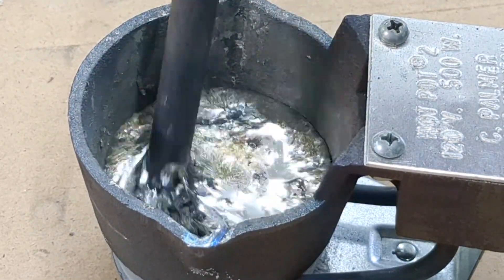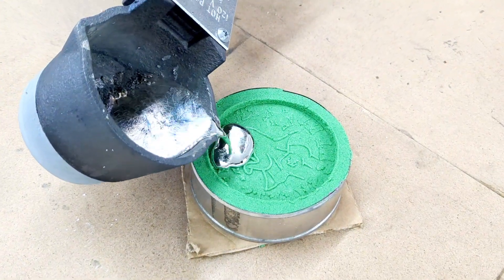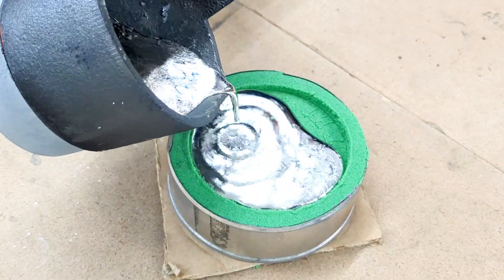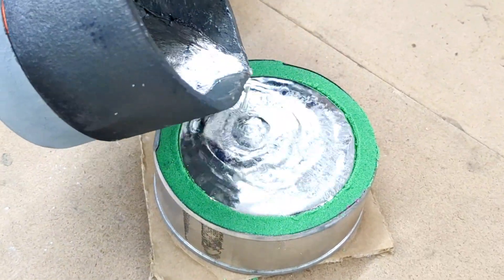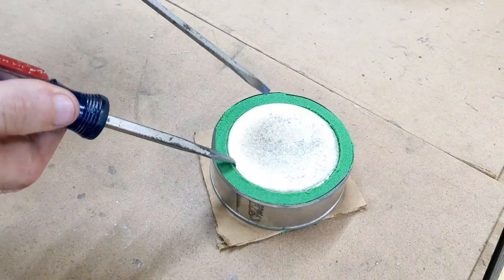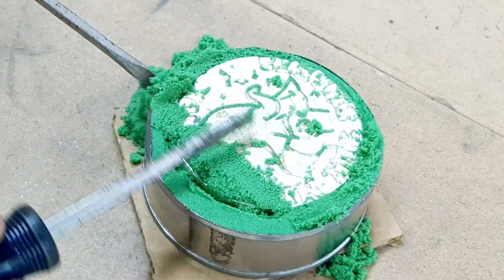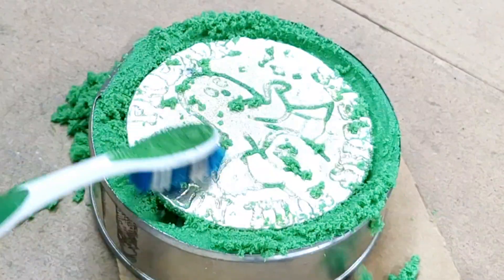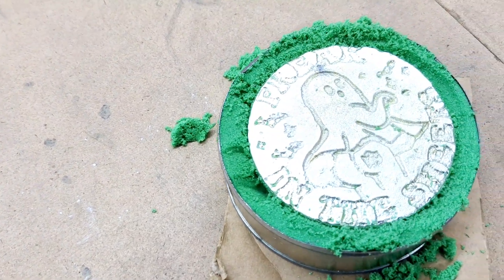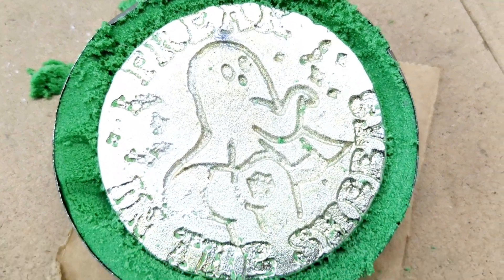Now I'm going to melt down some more pewter for another cast that I just made out of sand — again I'm using kinetic sand, this is going to be the green stuff. As far as this pattern goes, I didn't really like the way it came out when I carved it with my CNC. I actually used MDF instead of solid hardwood — I'm going to be redoing this pattern, but I figured I'd give it a shot and see how it comes out.